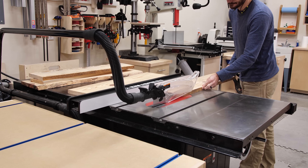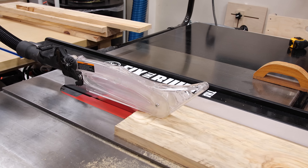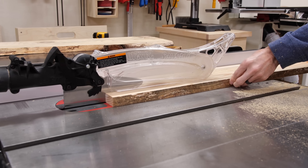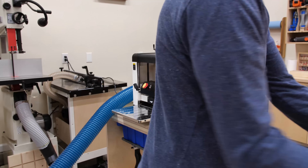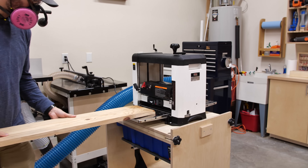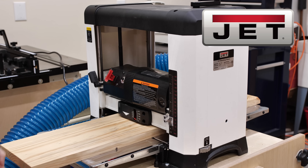Each shelf is going to be made of a wider piece and a narrow one. I had to vary the cuts on the boards a bit to make sure I could get the same width when I glued up each panel. I had rough planed these boards previously, but since I face jointed one, I needed to take the others down in thickness to match. So I busted out my planer from Jet, the sponsor of today's video, and milled everything down to a strong three-quarters of an inch.